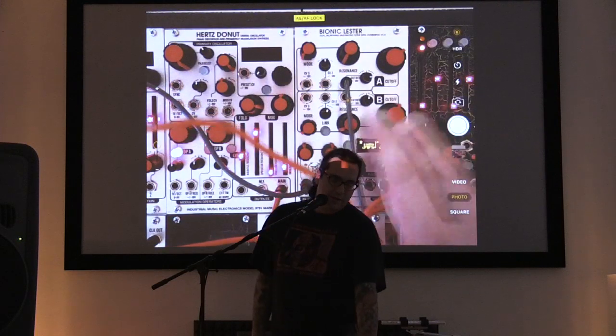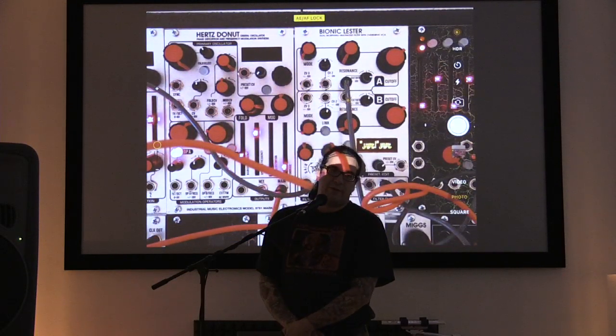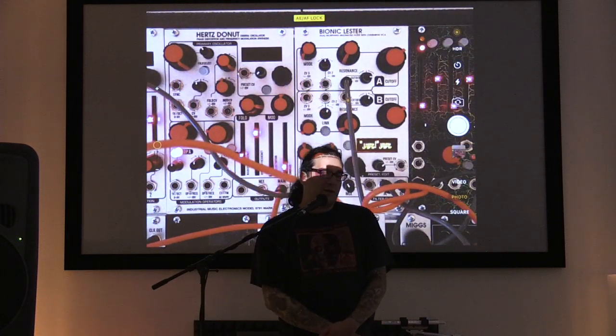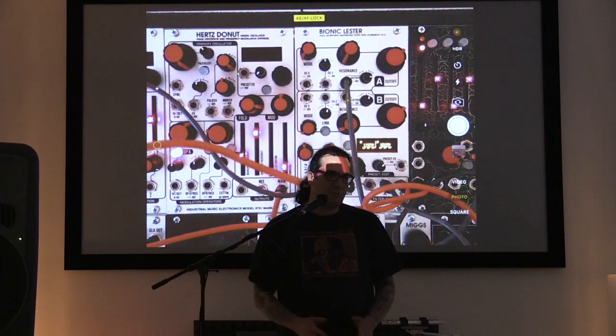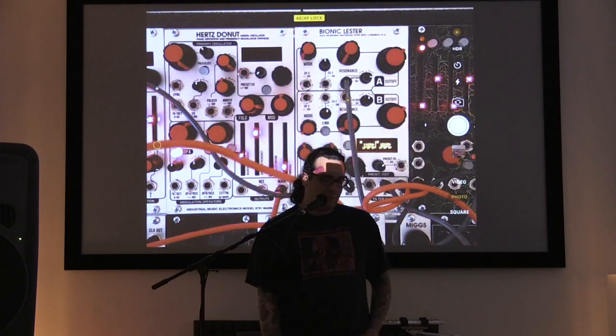But then the B controls, such as the big knob and the CV input, allow you to make an offset from that. So this is how you achieve a popular dual peak stereo bandpass effect, where the peaks move at the same time but with some distance between them. The distance being determined by the amount of offset in the B knob.